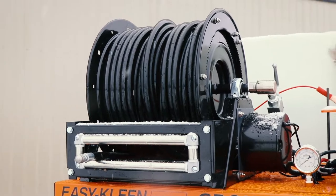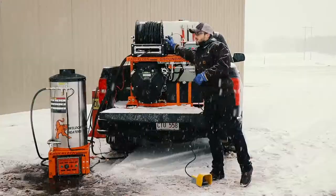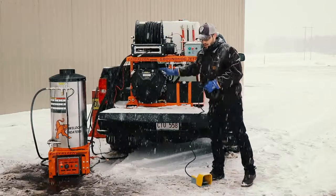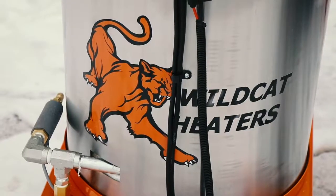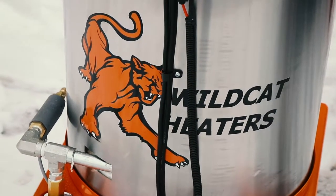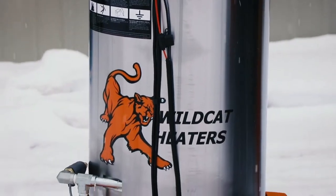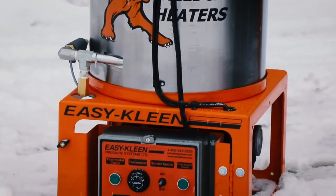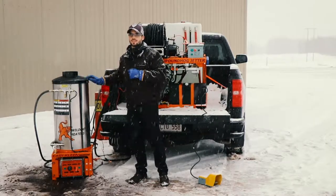Over here, we have a 300 foot, 12 volt hose reel with a super swivel that's greasable. Hose guides control your hose, and a foot pedal to reel your hose in. We're going to be featuring our coil heating package with this jetter today. 440,000 BTU oil-fired burner. It has a Schedule 80 pipe in it that's made in-house in our state-of-the-art manufacturing plant.